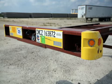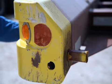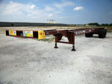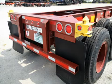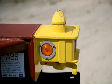Another difference from the standard chassis is the use of horizontal pin lock assemblies to secure the front corner castings of the container to the front bolster of the chassis. There are also some 48-foot and 53-foot chassis for domestic size containers which, since 2001, require special types of pin locks. This is necessary because there is no room between the bottom of the front bolster and the tractor trailer wheels to utilize twist locks. However, standard twist locks are used to secure the rear corner castings of the container to the chassis.